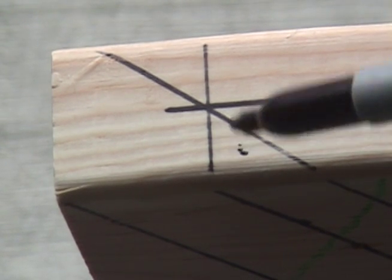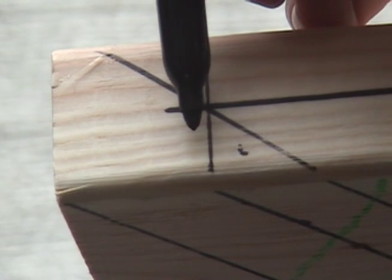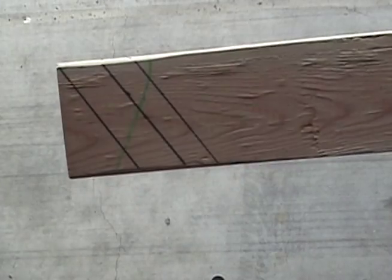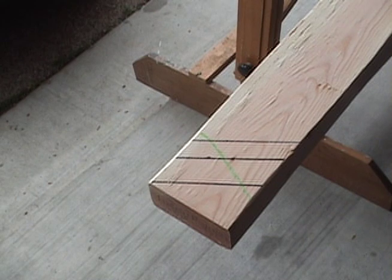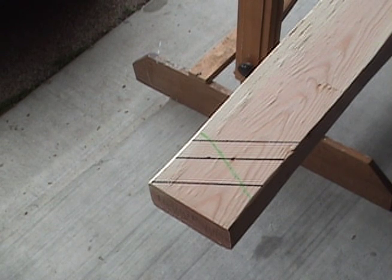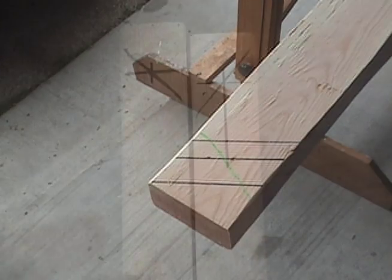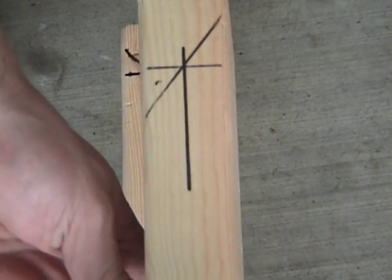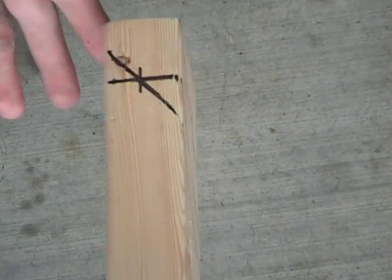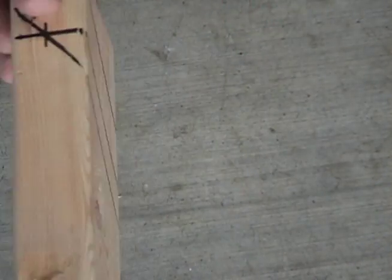Do you notice this triangle right here? If we know that this is three-quarters inches here and three-quarters inches there, that means this triangle is a 45-degree right triangle. You are done with the first plumb line! Make sure that when you do a single cheek cut on hip rafters, you do a mirror image of what we did — just do the same process on the other side of a second board. This one is the one we just made, and here's another board with the same angle but markings on the other side. It's just a mirror image, and that's what you do for single cheek cuts on hip rafters.